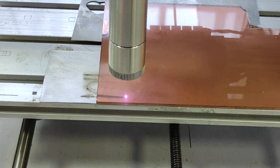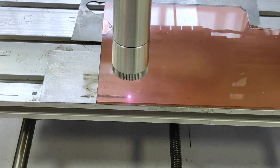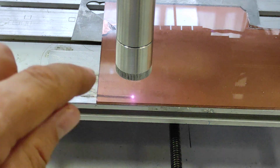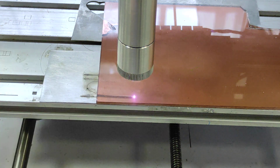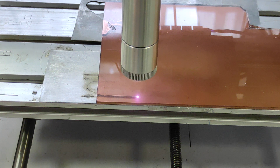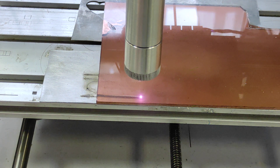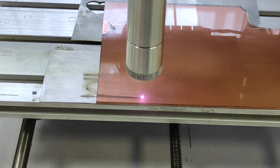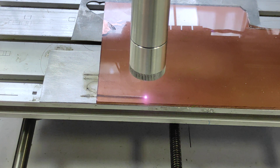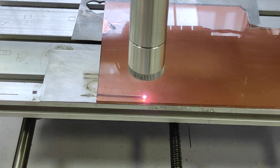You can see the line goes straight, and it's very important that you focus the laser not on the glass and not below the glass, but a little bit above, before the glass. This is a nuance for getting the best result, because we need to get the heat a little bit distributed under the glass. The heat doesn't burn or vaporize — it breaks the glass. It's a cold-heat break. It's an interesting technology.